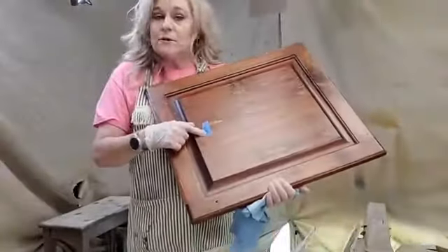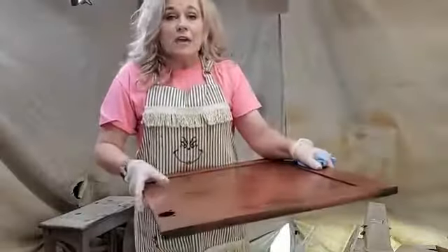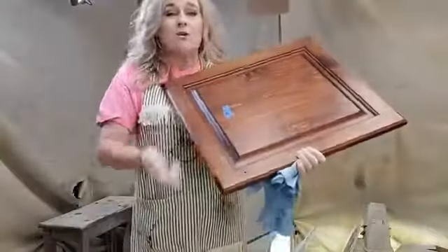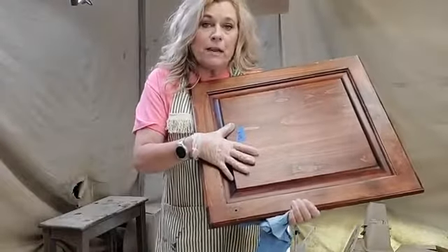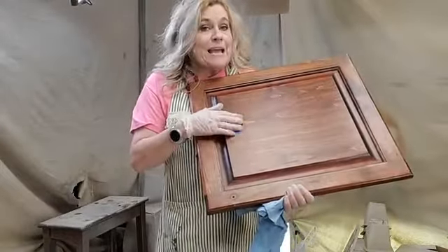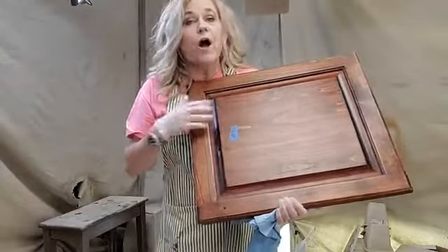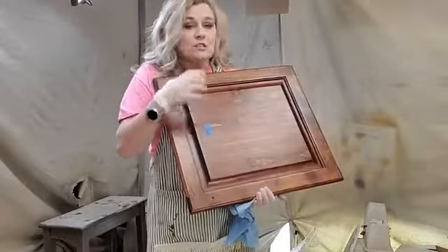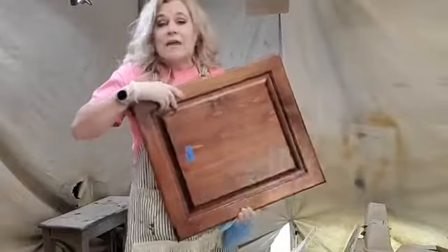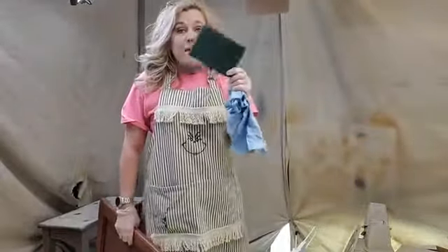I use a lot of blue painter's tape. If you get good adhesion, you can move that sticker from the back to the front and back again without worrying about it pulling any paint off. But if you don't clean these cabinets well and you put that blue tape on there and start to pull it off, you can pull your paint off. That's why you really have to scrub and clean. The Scotch-Brite pads make all the difference — they scrub that stuff off. Don't quit scrubbing on those kitchen cabinets until your shop cloth comes off clean.